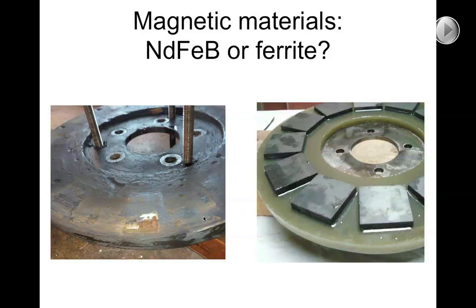I recommend embedding them really carefully and putting a layer of resin and fiberglass on top of the magnet. Don't squeeze the resin dry on top of the magnet — make sure it's really well protected. If the magnet rotor rubs on the stator and the coating gets damaged, sooner or later corrosion will start, causing the magnets to swell up and ultimately rub on the stator.